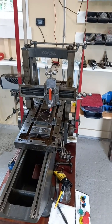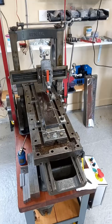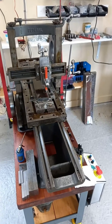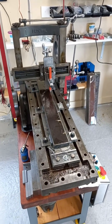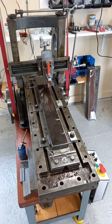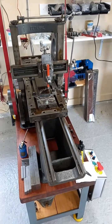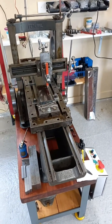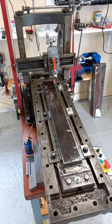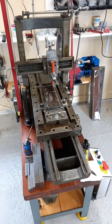They are peeling chips off quite nicely — beautiful, there you are, a nice cut. This looks like it's cutting for the full length now. This is only driven by a one horsepower motor above, flat belt drive, so we are going to lose some power through the drive itself — there's always some slippage with flat belts. But it's doing well, I'm really pleased with that. That's cutting beautifully. You can see all my fixtures there — everything wedged in, can't move. When we've done this pass we'll check all those wedges to be sure everything's okay.